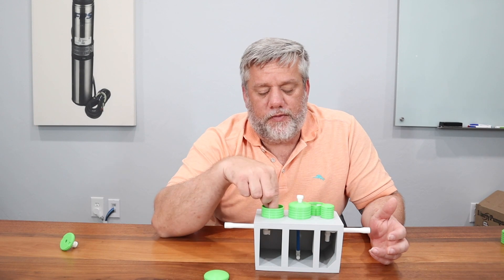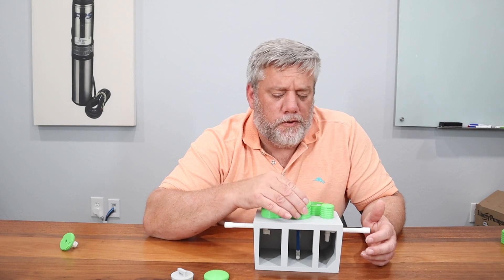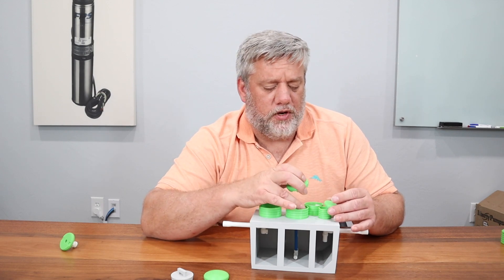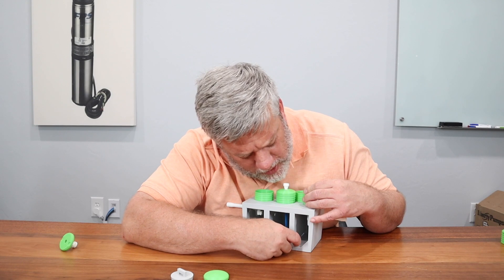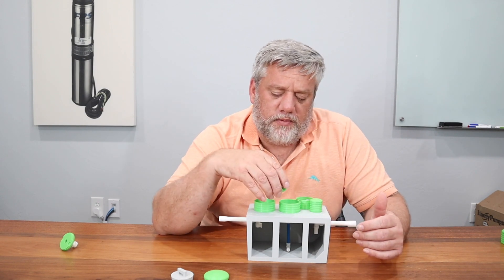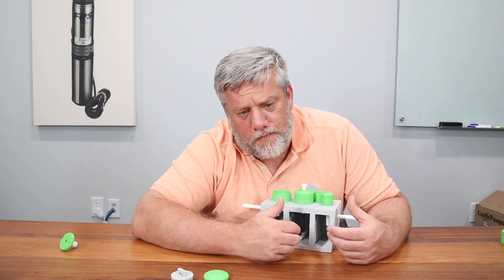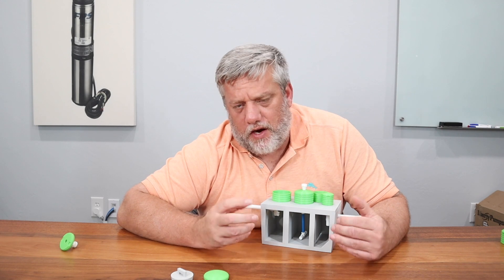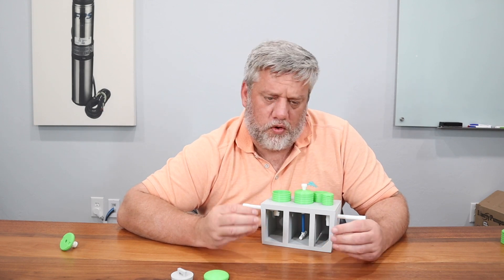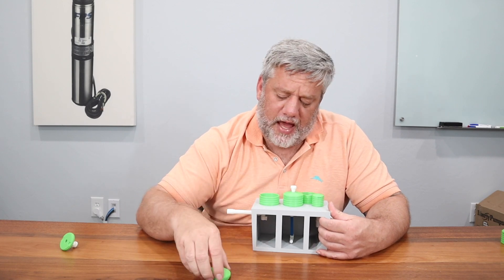These tanks are good because they're easy to clean out. You can open up the lids, get your hose in there, and clean them really well — everything's very visible. It's easy to clean the clarification chamber, and generally when you clean this chamber you can get everything out of there. You can maintain them easily. The diffusers come out; on these systems they're generally high-flow, long-bar diffusers. They don't generally clog up — they're a coarse bubble diffuser, don't need much maintenance, and they did a really good job designing that diffuser for wastewater treatment on homes.